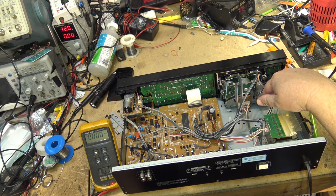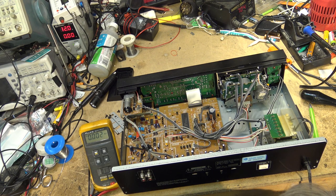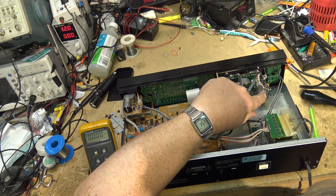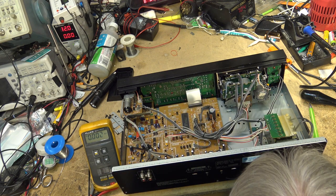And you see, it did until they put the motor in. As soon as they put the motor in, well, nothing spun up right away. Well, why is the motor not turning? And, well, that's the reason why. Is because it's grounded out. Now, I may be able to take that off and isolate this motor. Hopefully that's the case. I can just take this little solder blob off here that's on the motor, and I'll be able to use it.